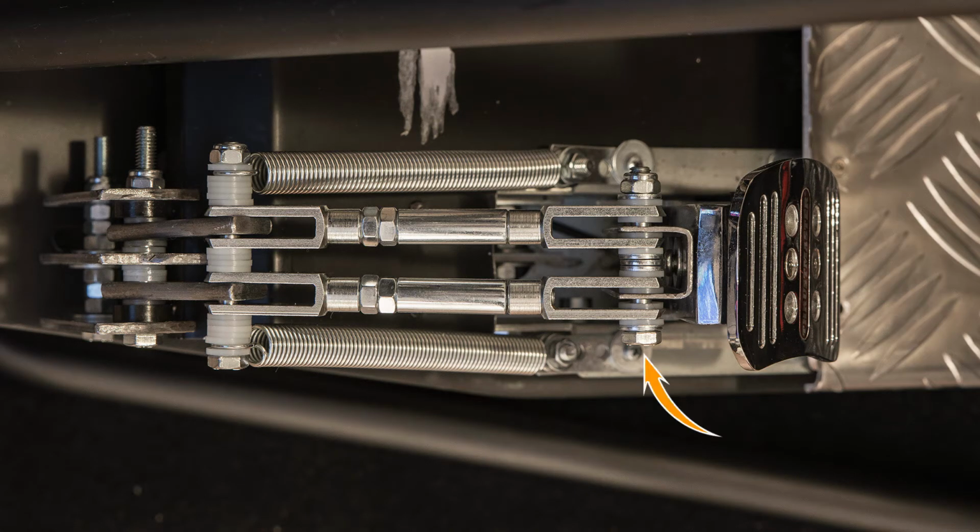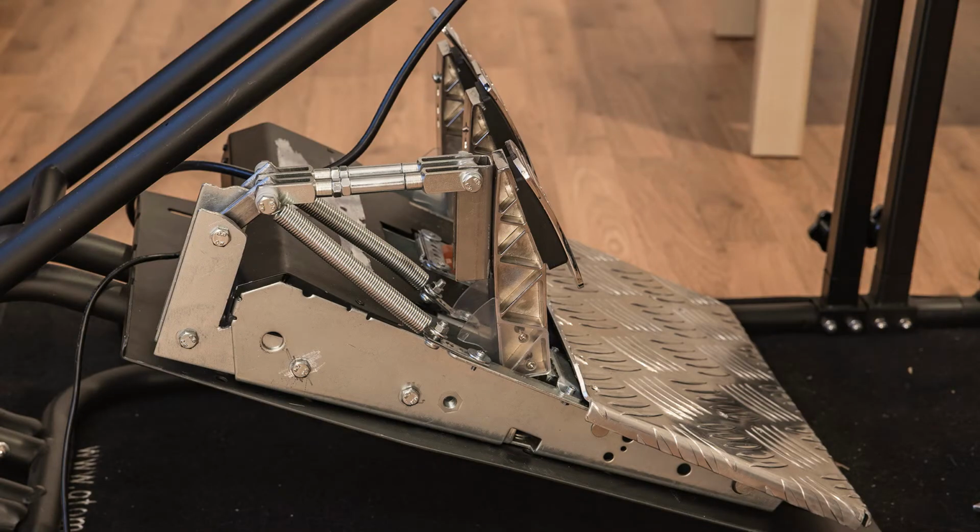So the 3 axes themselves are M6 screws, where the first, I think like 42 or so millimeters are unthreaded. I put in a lot of washers between the fork heads and the short arms and so on in order to reduce the slackness, and I used mostly plastic washers in order to keep the noise to a minimum.